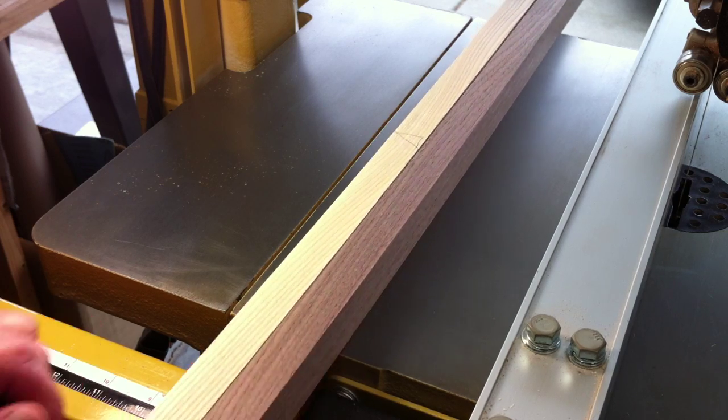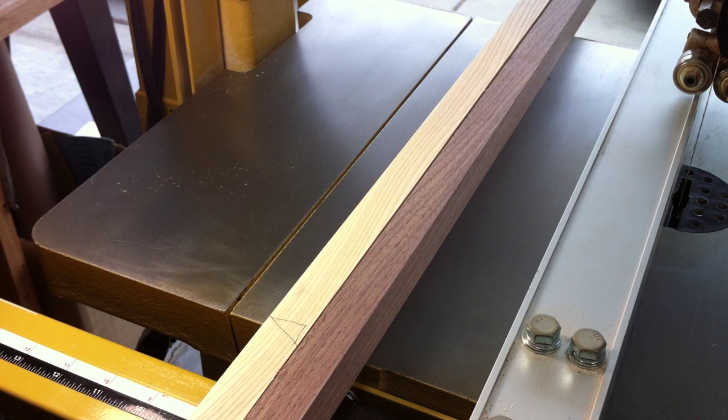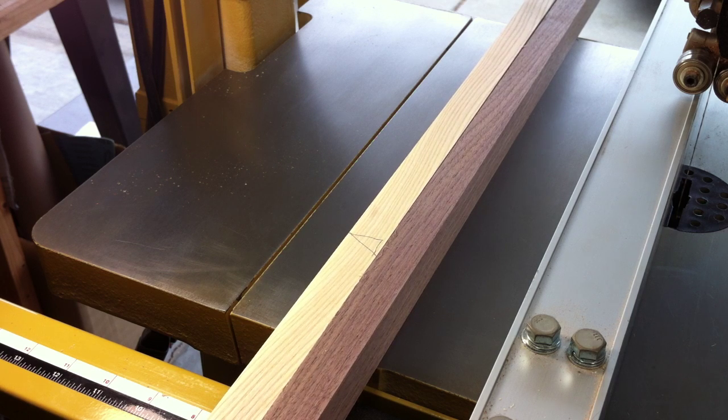But I've gone ahead and put in a wood slicer blade from Highland Woodworking in Atlanta. It works really well for ripping wood. I probably could have just used my regular blade, but it cuts through these things like butter. So I'm just going to go ahead and use that. So we'll rip these strips, and then we'll be closer to bending them around the form.